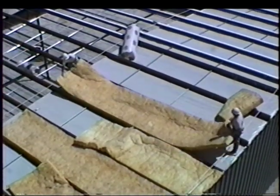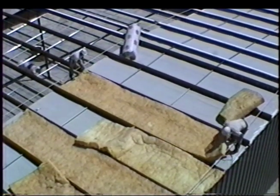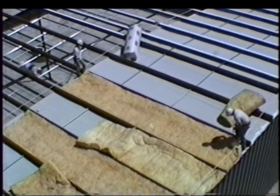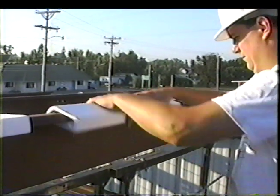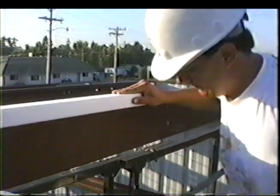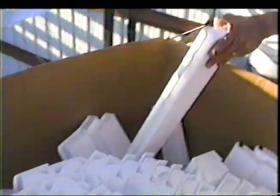The Simple Saver System allows the use of many different types of insulation. The most common type is fiberglass. Unwrap unfaced insulation rolls or batts and position them neatly on top of the liner system between the purlins. A second layer of insulation can be installed over the top of the purlins and first layer of insulation, or a separate thermal break material may be used. This will add additional R-value. For best results, install the SNAP-R just prior to or during the roof sheeting process. After the cavity is filled and thermal breaks are in place, you can now install the roof panels.